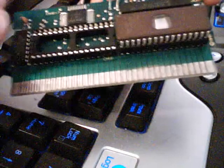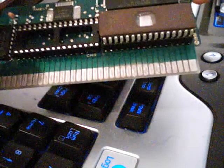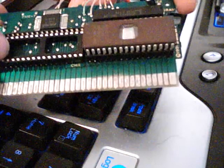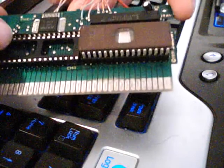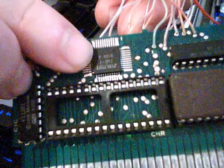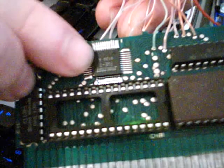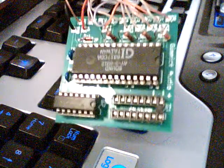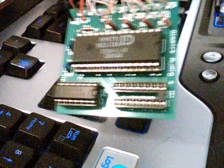You can see I've already socketed it. This is my test board, where I test the EEPROMs and my other chips. I've already ripped out the EEPROM I was using for the character ROM, and I've probably erased it and used it for something else. You can see it's Sunsoft. It does say FME7. Actually, I'll go ahead and turn it. Sunsoft FME7, and you have to wire in the extra. This is the extra board. You can see I've already pulled pieces off it also.